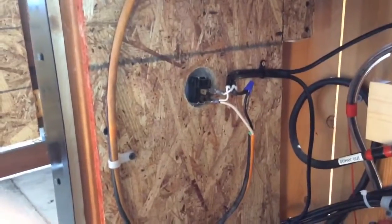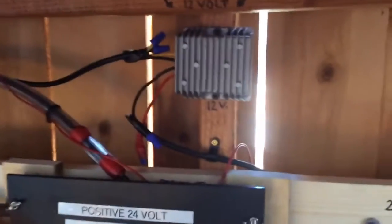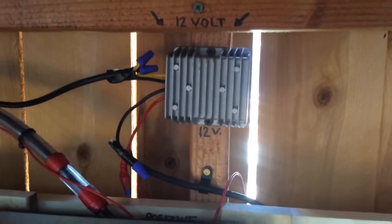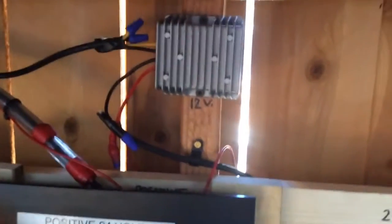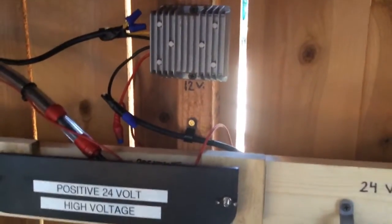This is a little fan - I can turn the fans on and off, the little switch goes over there. This runs off 12 volts. Right up here - there you go - 12 volt step-down converter. You buy this little sucker for 20 bucks, tie it into your 24 volt battery and you step it down to 12 volts. Now I can run 12 volt fans. This is a 12 volt fan and it all runs off that little step-down - get a 360 watt one. Always go bigger than what you think you're going to need.